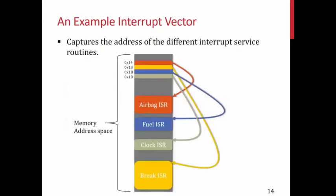That vector table is somewhere at the top of your memory range. And what does this vector table have? It just has the address of where your code is stored. If you look at this vector table, each entry is only one line, correct? And what is in that one line? That one line does not contain any code. It only contains the starting address of each interrupt service routine, the address of where my interrupt service routine is